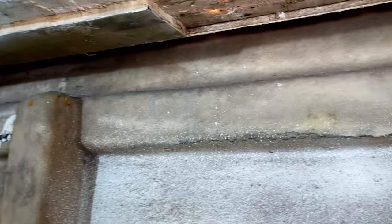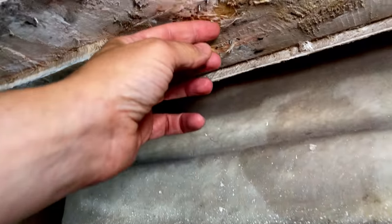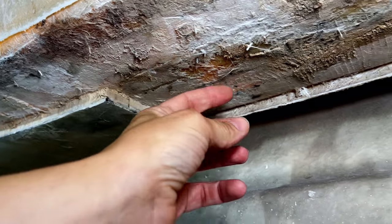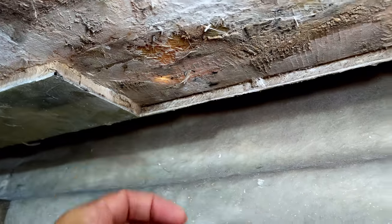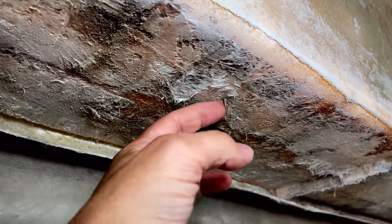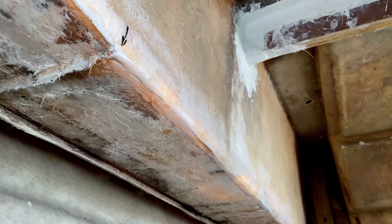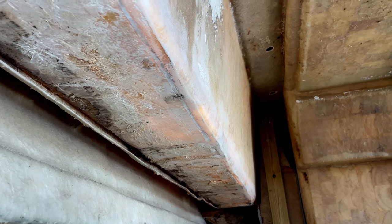But what we have got is lots and lots of these little screws poking through that we use to hold the teak deck down, and they're all along here. This walkway is absolutely peppered with them, and that's what's caused our balsa to go rotten. So it's got wet and then gone rotten over the years. So what we need to do is we're going to draw all of these screws out.